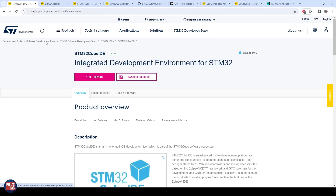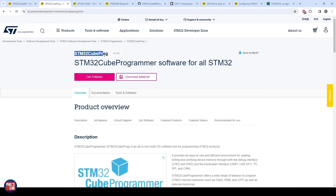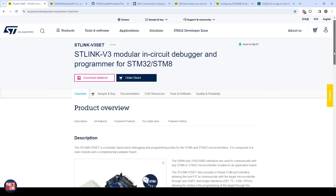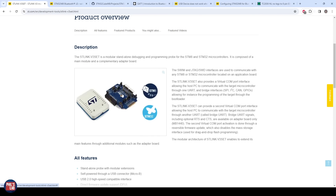If you'd like to follow along, I'd strongly suggest downloading STM32 Cube IDE — a free integrated development environment I predominantly use when developing with STM32 microcontrollers. It helps with setting up peripherals, pinouts, and programming the device. Also very useful is STM32 Cube Programmer, also free. We'll use it to flash firmware and to flash the wireless stacks. For programming the device, I'd suggest investing in a debugger — only about 10–20 euros. The latest from ST is the ST-Link V3, which plugs into your host computer via USB and connects via Serial Wire Debug or JTAG to your custom hardware.